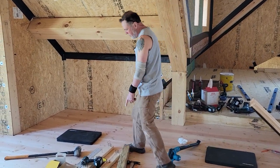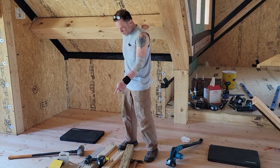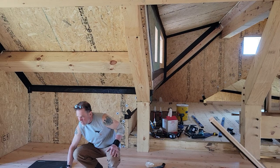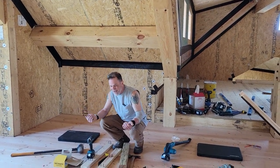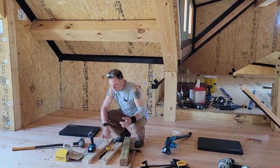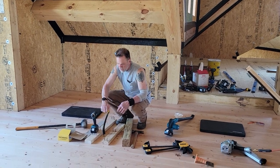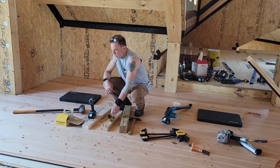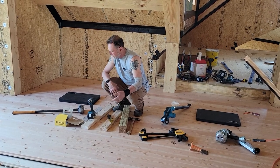You'll need some two-by-fours. When you have a board that doesn't want to line up and get tight, you put the two-by-four very close to it, screw the board down to your joist, take a small pry bar, pry, and you'll pull the board tight. Then you nail or screw it from there.